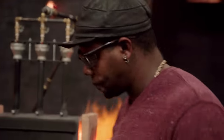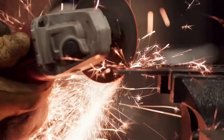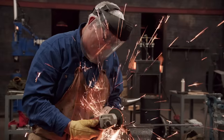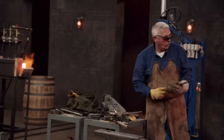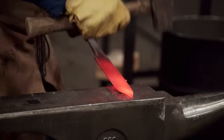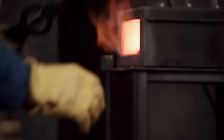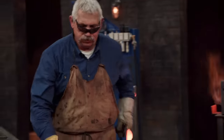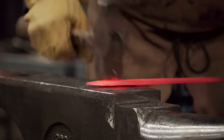It is very nice to know the judges were paying attention. Now Brotzak has a spear tip point, so he does a Japanese tip cut. Mark has got a very lean blade, and those farrier file ends are rounded. It's very easy to draw a tip out of that — instead, he cut a preform, so he's lost even more material. When he gets to the grinder, he likely won't have much material left. I would venture to say that Mark's forging on that was the absolute minimum he could possibly do. Without reforging that metal entirely, he won't know exactly how strong it is.